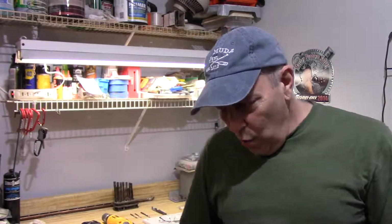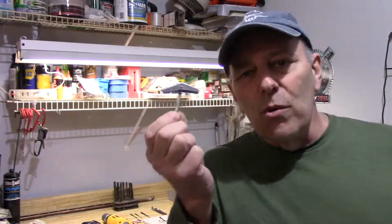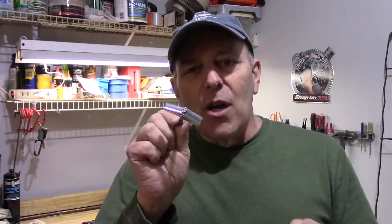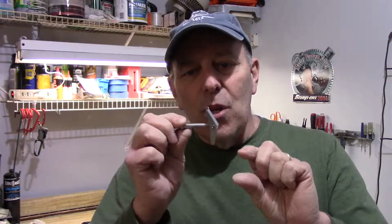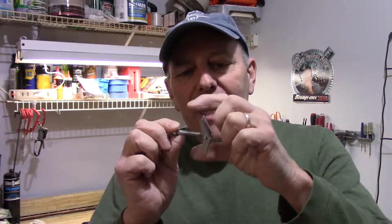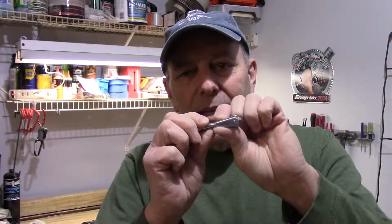And if you have something extremely heavy that's going to hang on a wall, you're going to use something called a toggle bolt, or there's lots of different names out there for it, but basically it's something like this. This is meant to hold something that's extremely heavy from a drywall. Now sometimes you can actually screw into a beam, other times you can't screw into a beam and it goes into a hollow area behind the sheetrock. When it goes into the hollow area, that's when you need to use something like this. As you can see, this one folds flat like this, and it's actually that size.